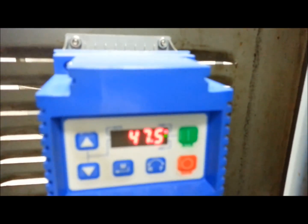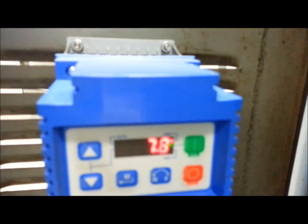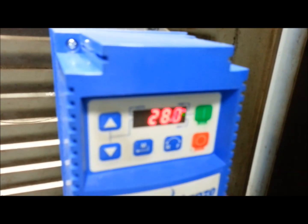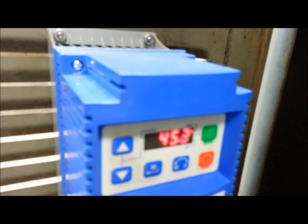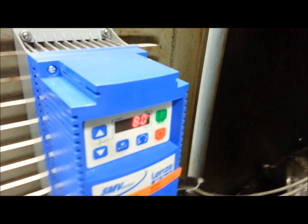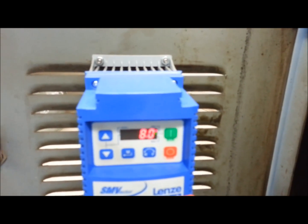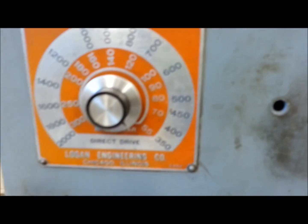If I flip the off switch it's set to ramp down, so it's not trying to stop a huge rotating mass. It'll ramp down, and when you turn it back on it'll ramp up to avoid belt slippage or any other locked-rotor conditions. These units are nice — you can make the display show whatever you want. Right there it's referencing Hertz, so that is running at 8 Hertz, at my minimum drive speed.